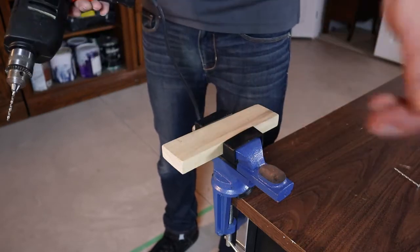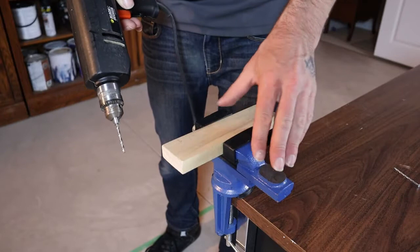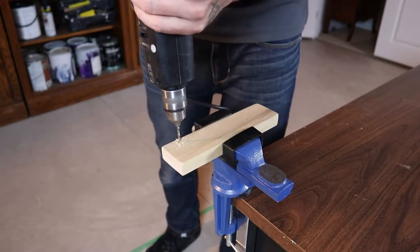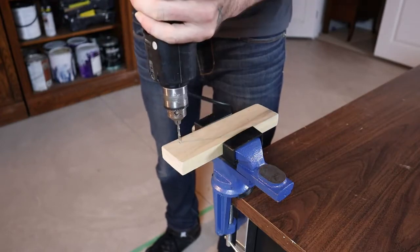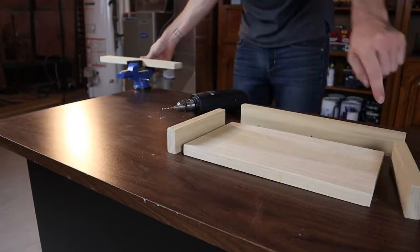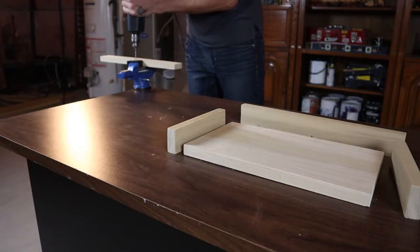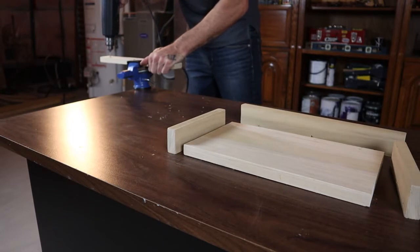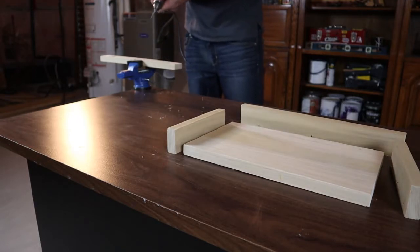I'm going to pre-drill these holes just very slightly bigger than the nail itself. I'll stick them in my vise — this is a little bench clamp-on vise, the handiest little vise I've really ever had. Links to all these tools will be in the description below. Make sure your drill bit is tight in your chuck — I had a minor technical difficulty there. As you move pieces around, it's not a bad idea to mark them so you know which side they go on.